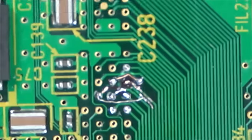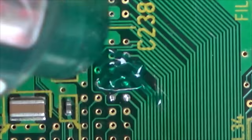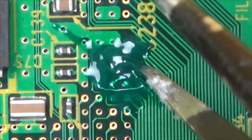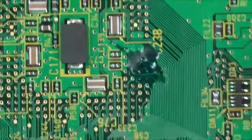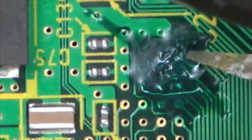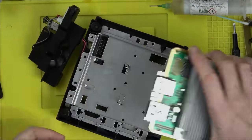Let's get some solder mask on here. I didn't dream the heat sink would come off so easily — if I did I would have done it at the very beginning, just heated it with hot air. The GameCube being on generated enough heat to slide that heat sink right off — definitely no damage to the balls, it just twisted off no bother at all. It's all a bit of a learning curve. Next time I work on a GameCube I will be a lot wiser. I put the solder mask on quite thick, UV light for around 10-15 minutes, then pierce the surface to let the wet underneath ooze out a bit, then apply the UV light again so it thickens underneath as well. Next time you see this it will have the solder mask done and be back together, and we'll end the video playing a bit of Mario Kart — amazingly it all appears to be working.